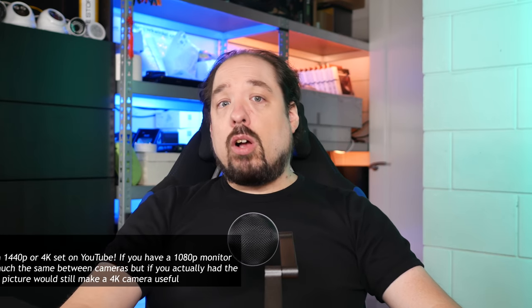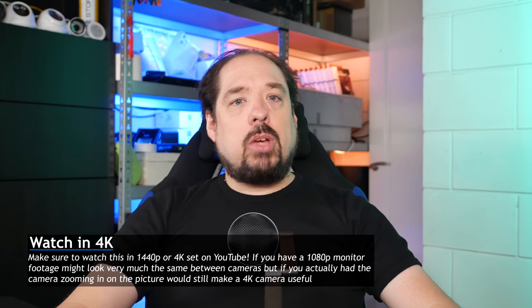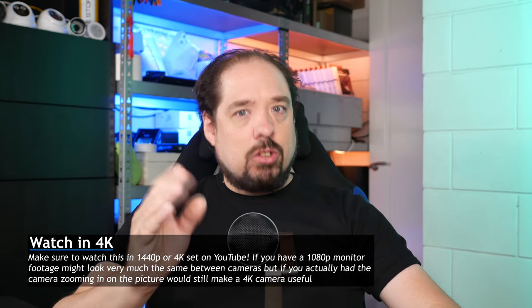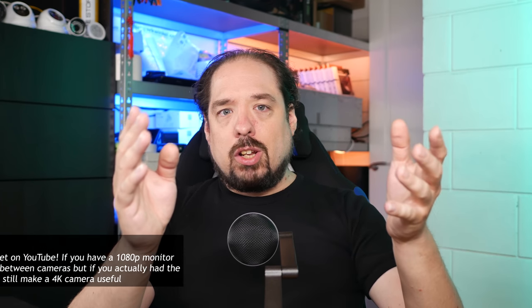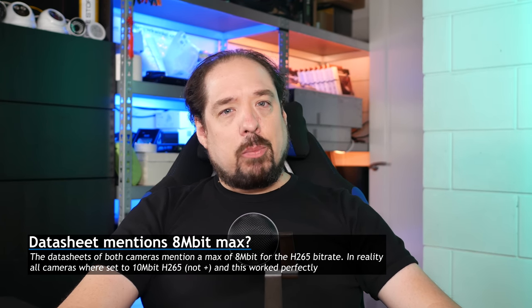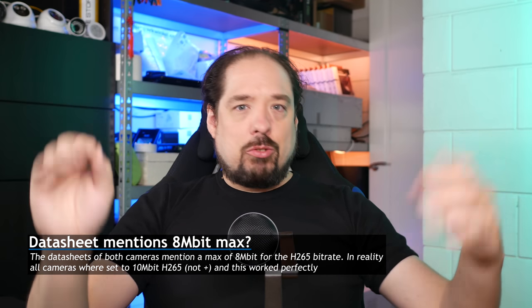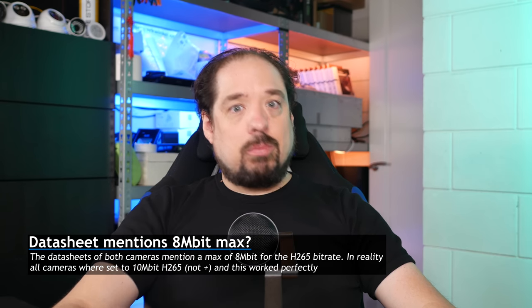Oh, I will not be offering the original footage as a download. I'm using some special techniques that make the quality loss from YouTube's compression and stuff like that as low as possible, so what you're looking at is pretty close to original quality coming out of the camera directly. All shots were recorded with the cameras set to 10 megabits in H265. In theory, that could give the 15 frames per second camera an advantage in recording quality, but I wouldn't run either of these cameras with that high a bitrate normally anyway, so for comparison's sake, that's fine.